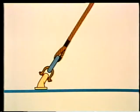This is the wrong way to rig the sling. The force is concentrated at the top of the eye. When you lift the load this way, a shoulder-type eye bolt bends almost as easily as the straight kind.